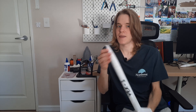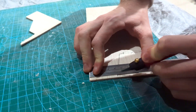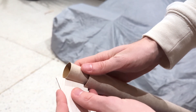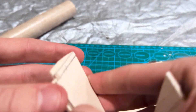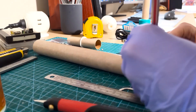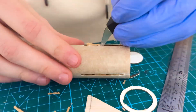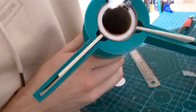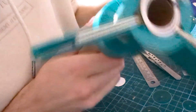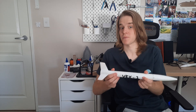VEX 1 was largely built with the same techniques as Nova, but with one key difference: the fins were placed through the wall. This is quite a common technique for high powered rocketry, as the aerodynamic forces on surface mounted fins can very easily rip them off. I wanted to try out this technique and learn from any mistakes before working on the fancy certification attempt rocket. All you really need to do is mark and cut the slot in the main body tube for the fins, push them through, and then glue them in. The hardest part is ensuring that they're still aligned. Once the fins are attached, a small fillet of glue is made to spread out any forces to the body tube over a smoother angle. No real problems came from any part of the design process, except for the very botched spray paint job.